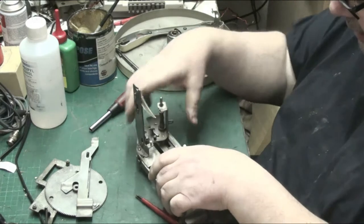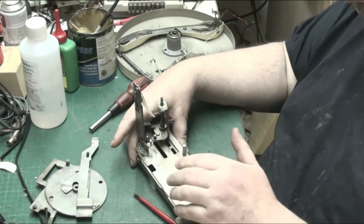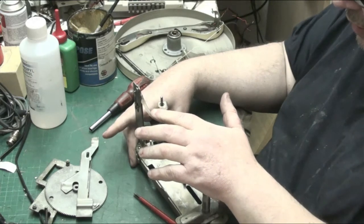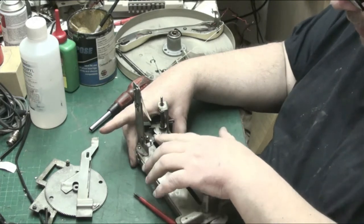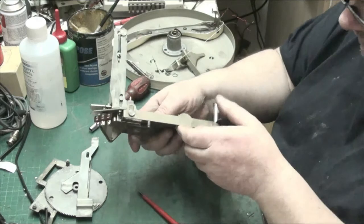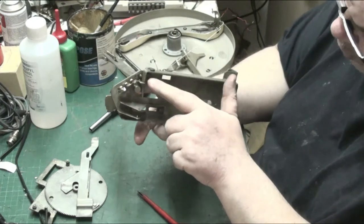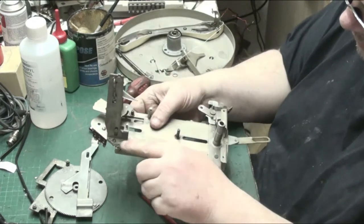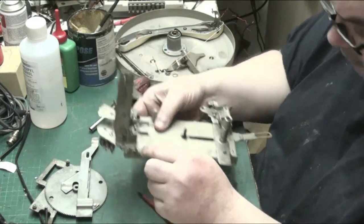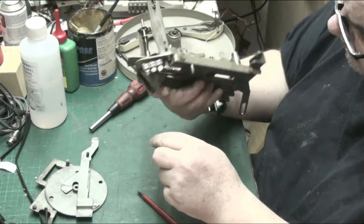So basically, record drops. If it's a 7-inch, doesn't change that. If it's a 10-inch, down one, 12 inch, down another, and as that goes down, the side here pops up. And this is actually the resetter, this bar here, so you can see it there, comes under, it hooks under that there, and that's the resetter. When the mechanism does that, when this is pulled by, I think it's the push pad, but we'll go more into that, it pops back up, and that's how it works.